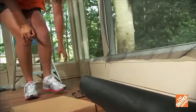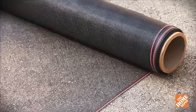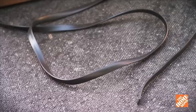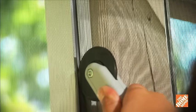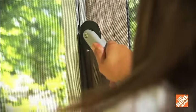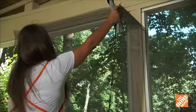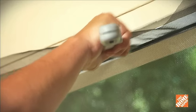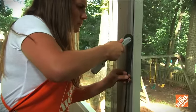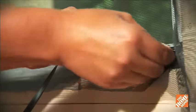To attach the screen, you'll need a roll of screen mesh — fiberglass is ideal for the FastTrack system. You'll also need the right size spline for the channel and the ScreenTight Professional Roller Knife. This has a special wheel for easy installation of the spline. Start at the top and stretch a section of the screen evenly across the channel. Roll it in starting at one end and working across — do the top, then the sides, and finally the bottom. Make sure the flat side of the spline goes in first and rotate the edge as you push it in.